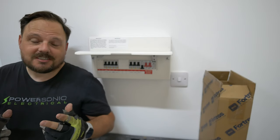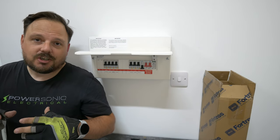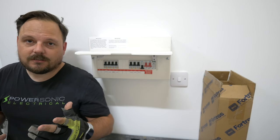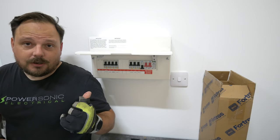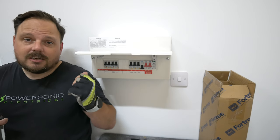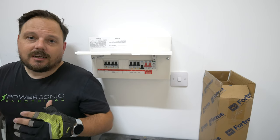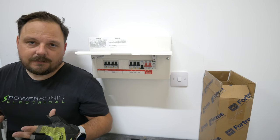I hope you enjoyed watching the time-lapse of me installing this BG Fortress board. I've tried to show how I go about approaching consumer unit installations step by step and talk through it, and I hope that some of the learners and apprentices following along from my content might get something from that. About the board specifically - for the price point it's hard to knock it. This comes as a kit from the wholesaler, apart from one RCBO I've got in addition to what was in that kit. Very reasonably priced, they're double pole, they're Type A, they have us covered for EV and PV.